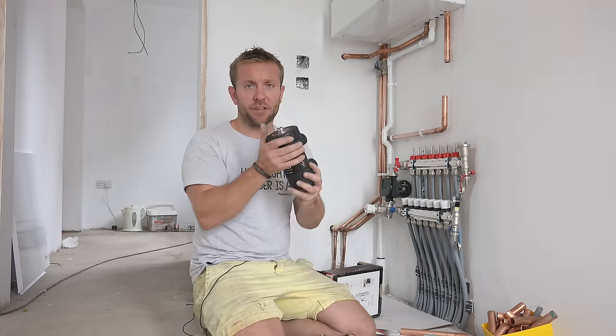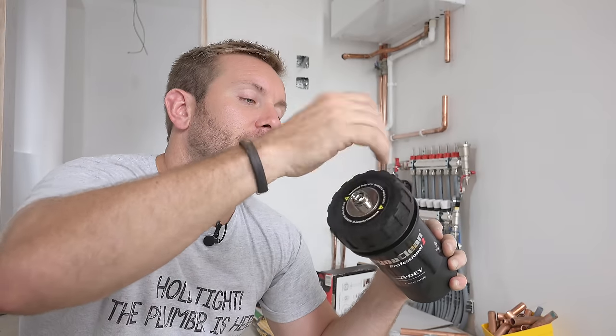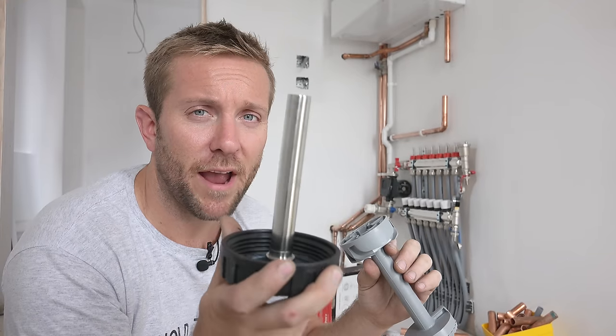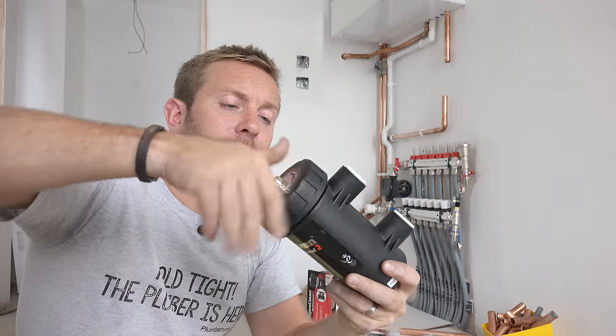Let's have a look inside this beast. I usually do insane close-ups on this sort of thing, but there's a magnet in it and it is damn strong — it could wipe the disc on the camera and also wipe my credit cards. So I'd love to get a nice close-up for you, but I'm not going to. At the top we've got our bleed screw. If I just undo this here, inside we have our little MagnaClean bit. This is our actual magnet — the thing that attracts magnetite in the radiators and the sludge. We've also got a little manifold that goes around it, funnelling water in and around the magnet as efficiently as possible.